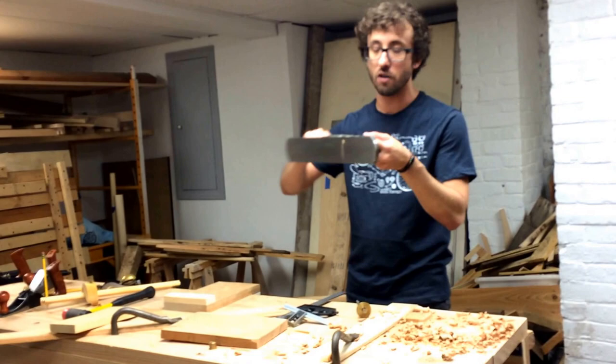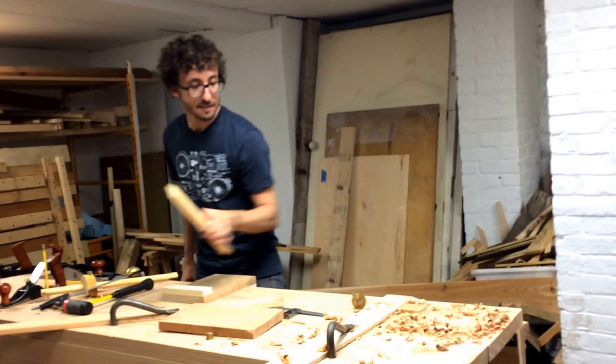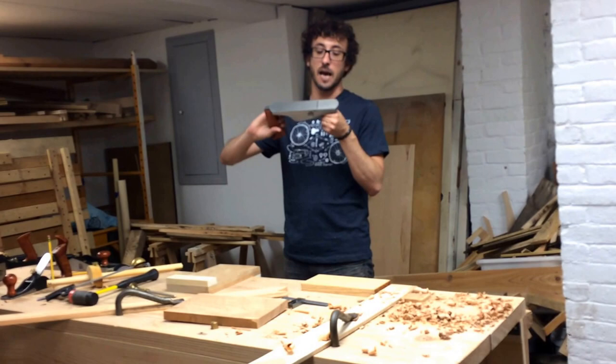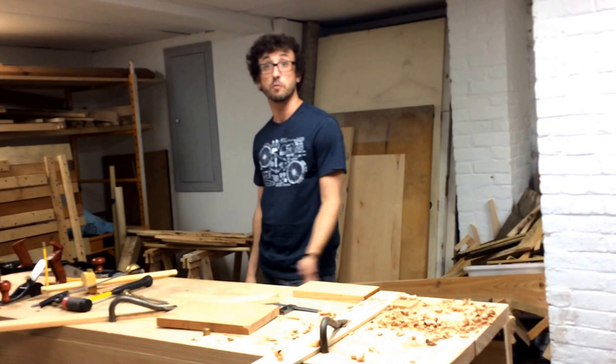There's a reason why it's called a jack plane. Most people buy what's called a smoothing plane first. This plane's job is to get rid of sandpaper. If you don't like to use sandpaper, this is the plane you grab, because it's almost always your sharpest plane. It is going to be your most finely set plane, taking a micron-thick cut. This is what you're using to get the board really smooth to the touch. You're trying to replace sandpaper with it, basically.